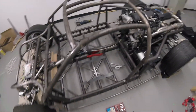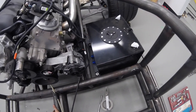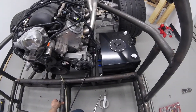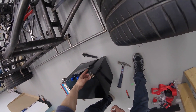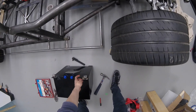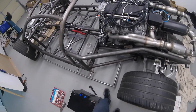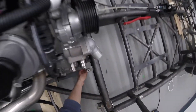Well, the joke's on me — splatter from the weld filled up the threads on the inside bolts. It took me an hour to get one off from here, and then the other side just popped off. I can't get the fuel tanks off. It was a bit of a failure — the standoffs, because of the angle, weld splatter was getting in and making it impossible to take off the bolts. So I'll just cut these off and make new ones, tucked in where the old ones were. At least I got two on this side — I pulled it off a little bit but I can clamp it down and just make another one.